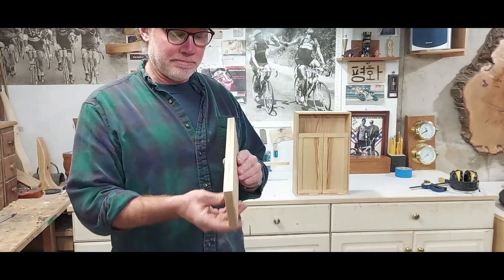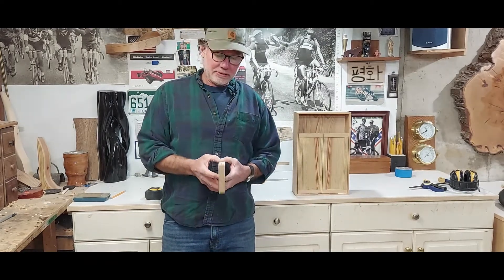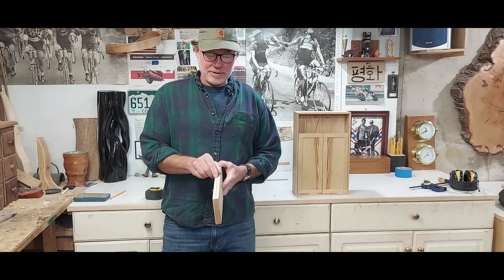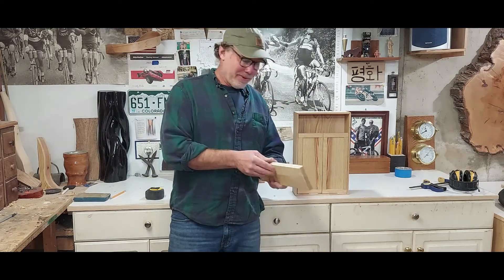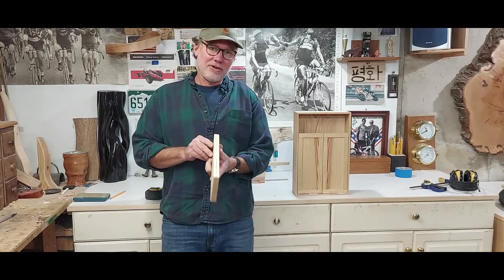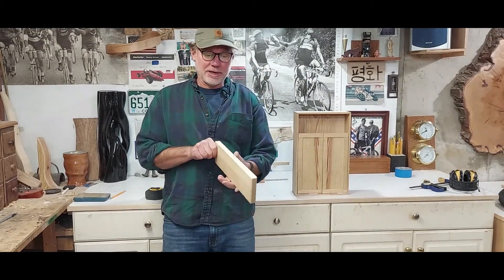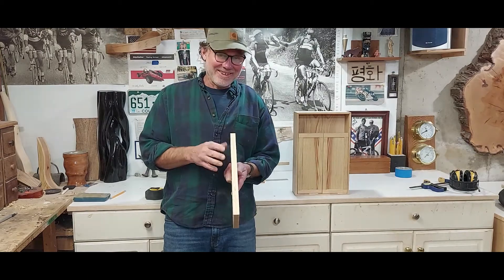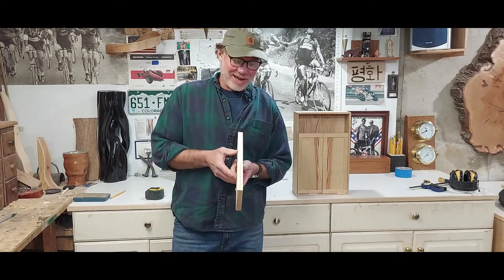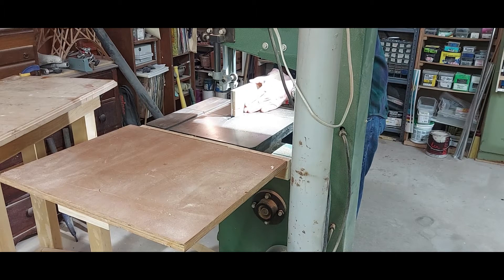I'm going to try and do it on the band saw. When you cut pieces like this, the table saw will take too much kerf — I'll be left with pieces after planing that'll be smaller than five sixteenths on the front, and it won't be big enough to do the front of the drawer either. So I'm going to give it a shot on the band saw. My band saw isn't very good, but the blade is only a thirty-second, so I have a little bit of margin of error. I'm either going to have one piece or maybe no pieces — I don't know exactly what's going to happen here, but we're going to give it a shot.